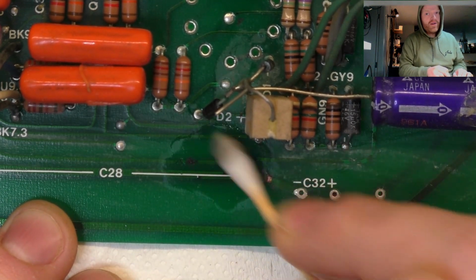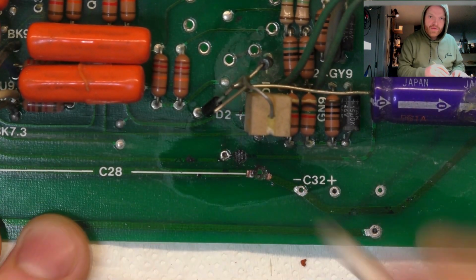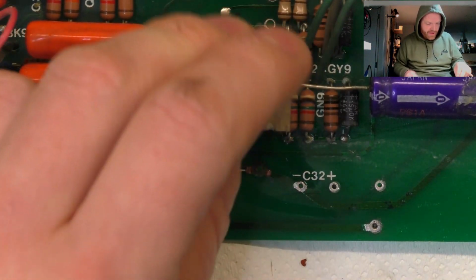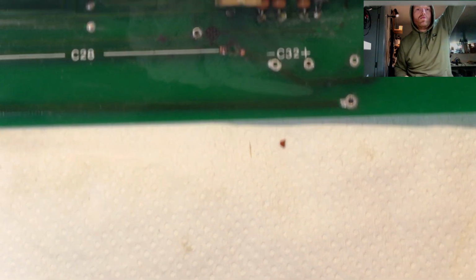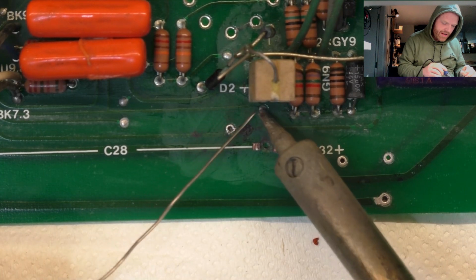And it looks like that pad may be recoverable, maybe not. I'm gonna have to run some wires no matter what we do. That pad's disappeared. Just evaporated along with the contamination as soon as it got heated. We've got another pad under there that's been affected, right next to that resistor. So we'll heat that up and I'll just show you what happens.